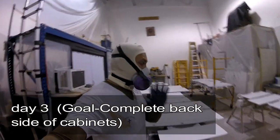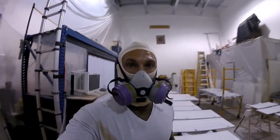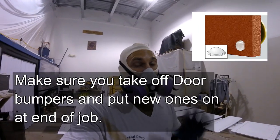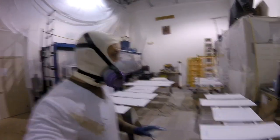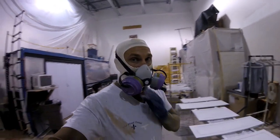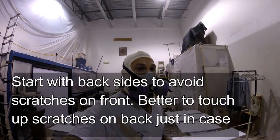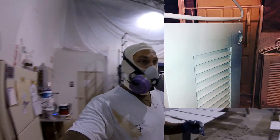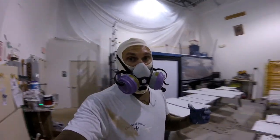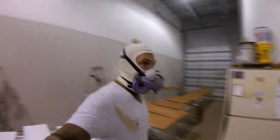I'm here at the office getting ready to do all these cabinets. I put the primer coat on some of these — I mixed in about 20% retardant because I'm in Florida, but it may be different in your area. You basically want to glob this stuff on as thick as you can. I lay them out flat because they dry within about 20 minutes, so I'm going to start to finish these today and then tomorrow I'll flip them over and spray the other side.